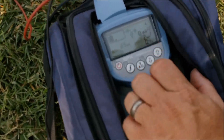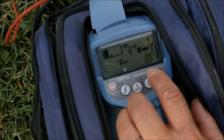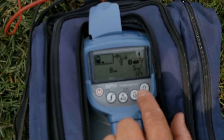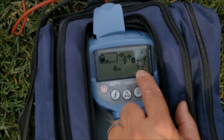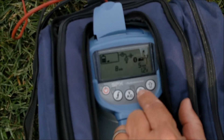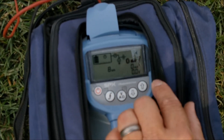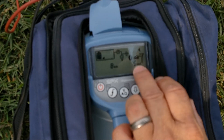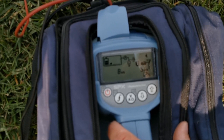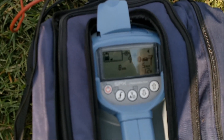The power rating is right here on the right side of the screen. I'm going to go to eight kilohertz — you can see I'm on one bar of output. The output is controlled by the up and down arrows, and one bar should always give you about five milliamps. If you're not getting milliamps and you're not getting volts, it's because you don't have the power turned up. If you turn it up to one bar and you get zero milliamps and maybe 29 volts, it's probably because your ground rod isn't all the way in, or whatever you're connected to is not good.